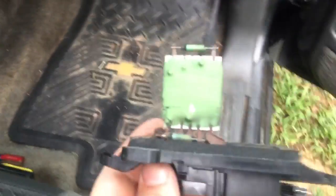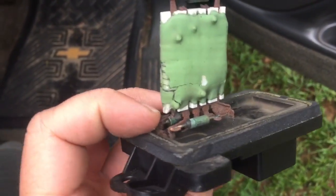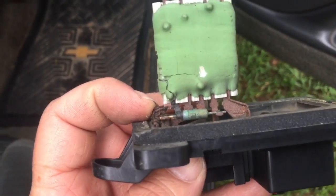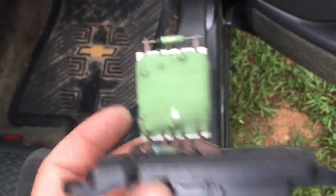The blower resistor has a bundle of wires plugging into it from the bottom and two screws which are 7/32 or about five and a half millimeter, and you can get that out. This plugs into the fan itself. Looking at it, this one it's pretty obvious what's wrong — I can see rust and corrosion, and this wire here is internally broken, causing issues.